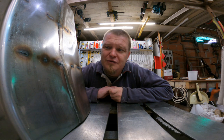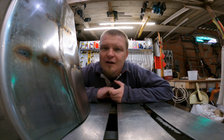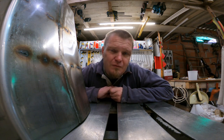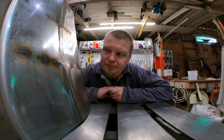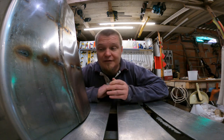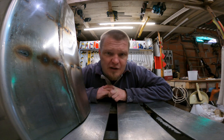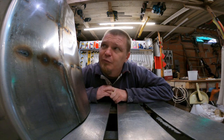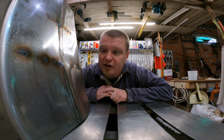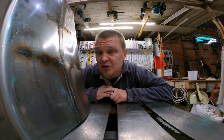Yesterday when I got out here, I was like, Noni. And this morning I'm more like, Noniin. The reason is my love-hate for stainless steel. I know my welding skills aren't up to par when it comes to welding stainless steel. And the consequence is that we have a lot of warping. Stainless steel is a little bit of a female dog when it comes to welding and distorting and its heat properties. So today I'm basically just going to fight that and see if I can put these things to right. So hence being a little bit noni.